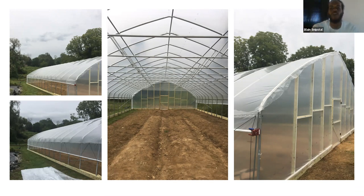And then for the end walls, very similar, you would install channel lock along your baseboard, and you'd pull another layer of plastic over it, wiggle it in the top, and then wiggle it in the bottom and on the sides, and that will give you sort of like a balloon on that gable. I'm thinking of polycarbonate for the end wall, so I would just be interested. Yeah, that's much simpler. Polycarbonate on the end walls is much simpler, and you'll get a better R value with polycarbonate.